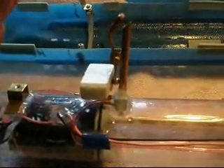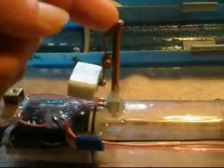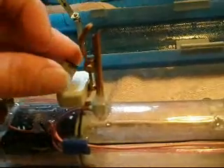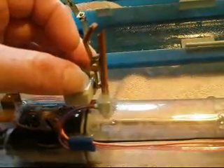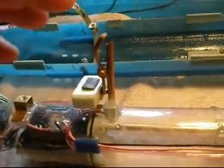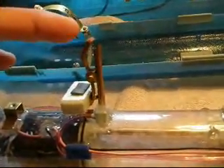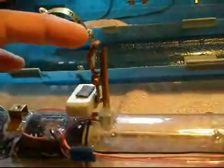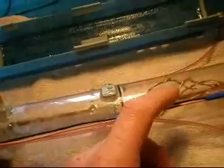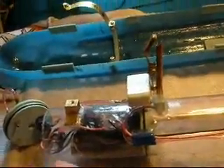The valve wasn't opening very smoothly, so I think the idea will be a piece of lead on top just to give it some more downforce. Now it will open much easier because the low pressure pump will create a slight vacuum inside the tube, so it needs some more force to open.